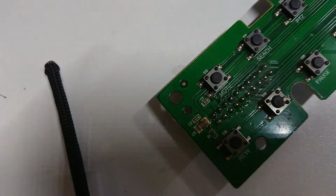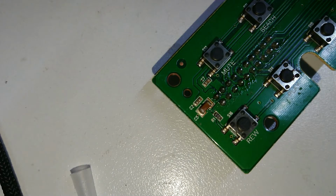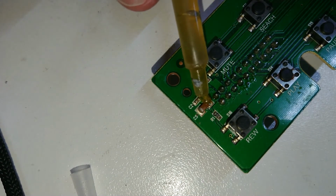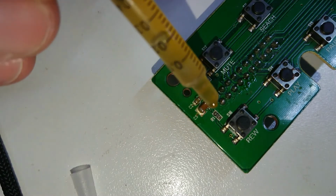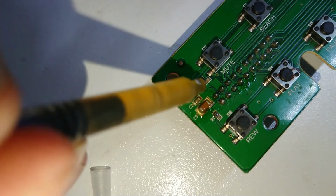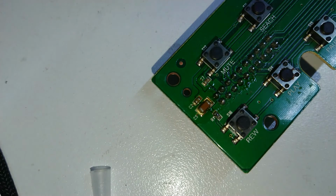Yeah, but just not quite hot enough. Let's go up a little bit more. Alright, I located the gift of flux from Tinkerman Mick. And wow, this board is very hot to touch at the moment. Let's get a bit of flux paste on this, with the hope that it might help get some of this solder flowing. This is all experimenting yet. I really haven't done a lot with this gun. In fact, the only time I've used a reflow gun in like the last 15 years has been Tinkerman Mick's.